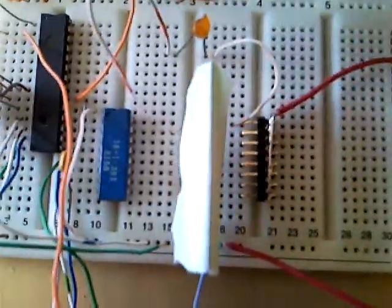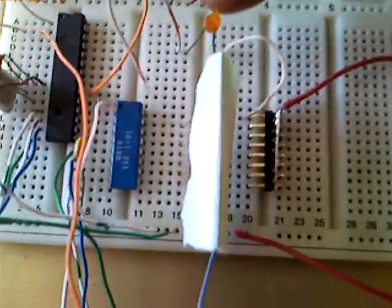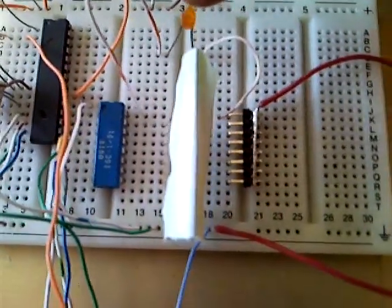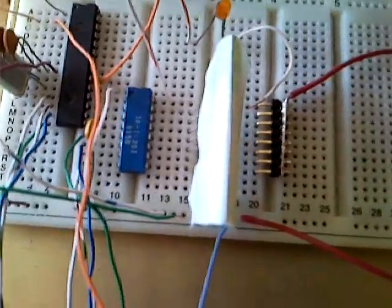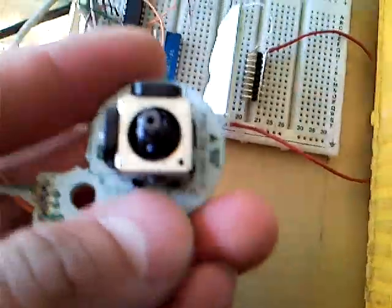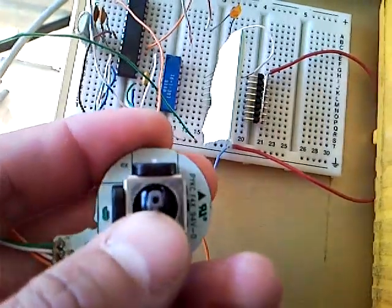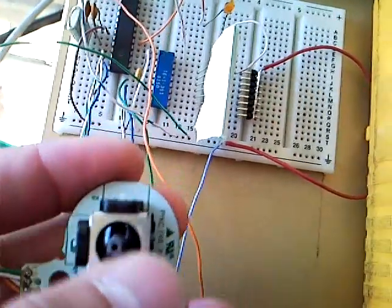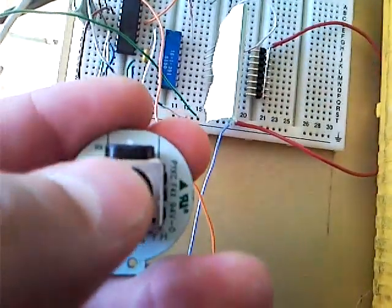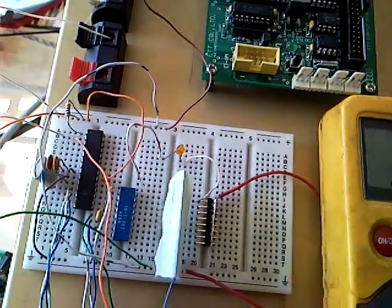This is the 8th LED up here, which would be like the most significant bit in the register. I set it aside because when the control stick is in the up direction past the middle, it will turn on indicating it's going up. Once I start pulling it down, it's going to turn off, meaning that it's going down.